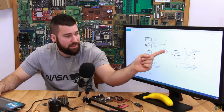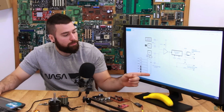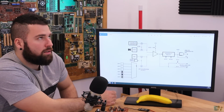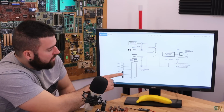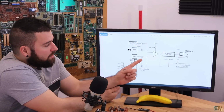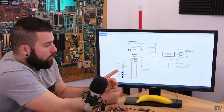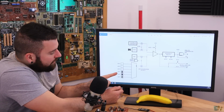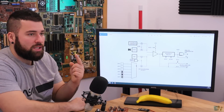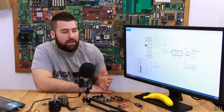We connect this to pin D6, which is the positive input of our programmable comparator, and then we have a multiplexer, a MUX. So by changing some registers in the code, we can select which of the ADC0, ADC1 or ADC2 or the other ADC are connected to the negative input. So for example, if the floating coil is the A, all we have to do is change the registers in order to connect the ADC2 to the input of the comparator. So in this way, using just one comparator, we can compare all the three signals. We don't need 3 comparators.